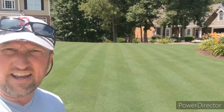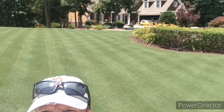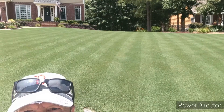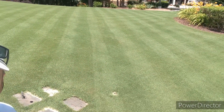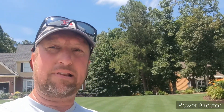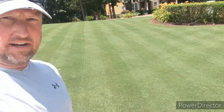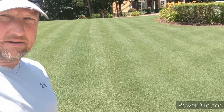Okay lawn fans, I just got done cutting the front yard today. From a week ago we've got recovery on the front yard — it was just a week late. I looked at everything and found out I needed my bed knife replaced on my reel mower, so I've got that on order. In the meantime I did some adjustment on the reel to bed knife and I actually lifted the height of cut up to one inch. I just couldn't get the grass to catch up to where I wanted to maintain it at seven-eighths, so I took it up to one inch.